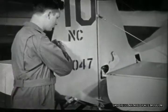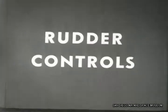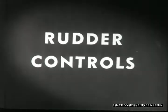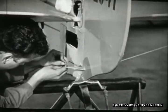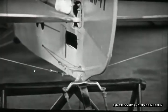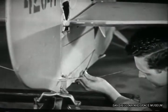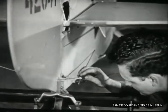When you've inspected the job and oiled the hinges, the elevators are done. When you connect up the rudder cables, you'll follow the same kind of procedure. Inspect them, then connect them to the horns with the specified type of bolts. Remember the rule for aircraft bolts: set the bolts with the nuts down. When both cables are connected and you're sure they move freely on the horns, go to the cabin and inspect the rudder pedals thoroughly.